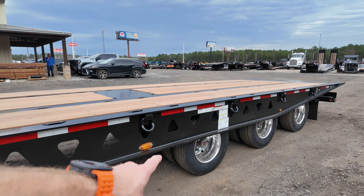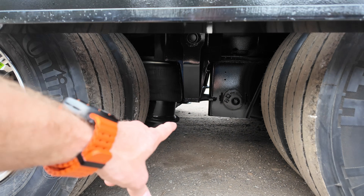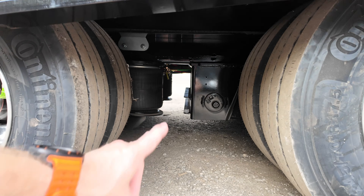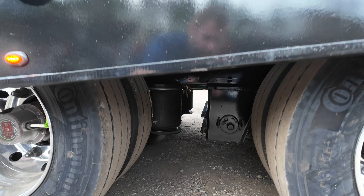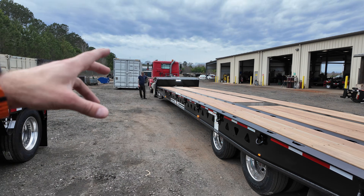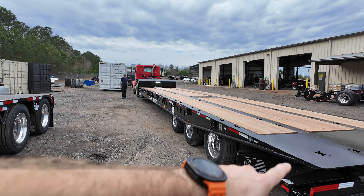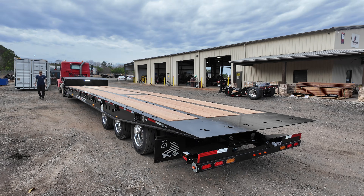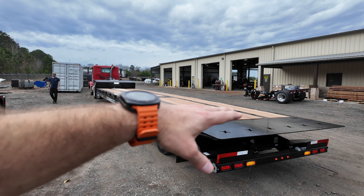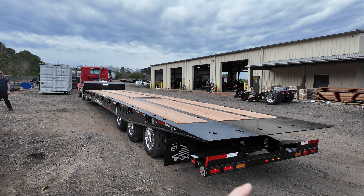One of the other features you'll see on a lot of especially the 55-ton trailers will be dock levelers — so there's another piston or cylinder that goes either here or here or sometimes both. What that'll allow you to do is when you get to a dock, say you're doing an inner-facility move, it'll lift up this whole tailboard to dock height. That way you could drive off stably onto a dock to get a big printing press or similar onto the dock of the new facility.